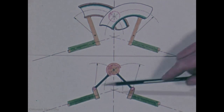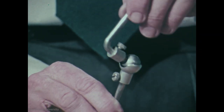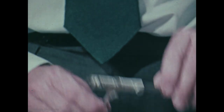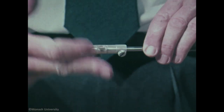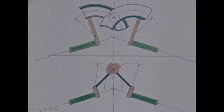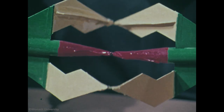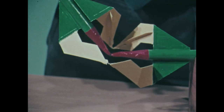Each reflected tripod connecting chain has five degrees of freedom: three degrees of rotary freedom at a ball cup joint, and one rotary freedom at each hinge. These five freedoms can be identified in the ball-in-track equivalents too. About a century ago, Clements, in the USA, patented a coupling based on two of these chains. He needed a central ball cup for constraint and symmetry, because he didn't use three connecting chains, but only two.